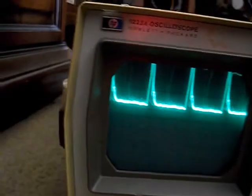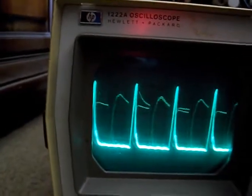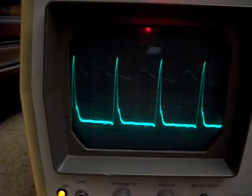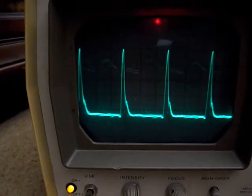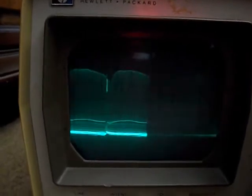That's a sync separator in action. I'm going to next do a look at the vertical multivibrator tube, which is where Sam's shows a picture of what it should look like with the brightness turned down and the vertical tube pulled, just so you can see what's actually getting through the integrator. When I do that, I'll switch this over to the vertical, which is probably going to be right about there. I'll come back to that in just a minute.